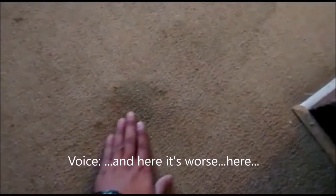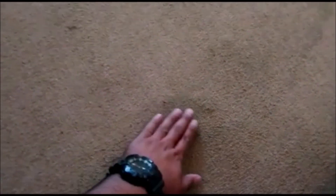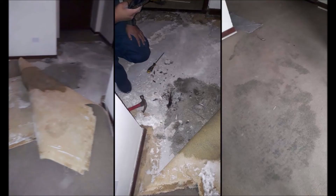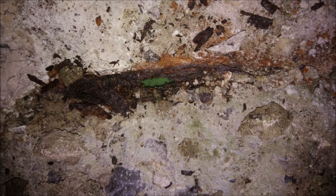In the following video we can see what can happen in gas tubing with extensive corrosion and big leaks when the person applying Produral R6-1 did not verify the conditions of the tubing or the leak rate. When applying the Produral R6-1, the pressure of the product over the corroded part of the tubing transformed a small leak into a big leak and a great explosion of Produral R6-1. If it wasn't for the carpet on the floor, the man applying the product would have become a green smurf. There was irreparable damage to the carpet and extensive damage to the concrete below it. As you can see, the hole in the pipe ended up being about one centimeter in diameter due to the Produral R6-1.